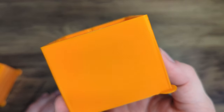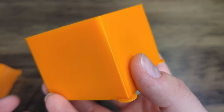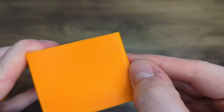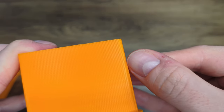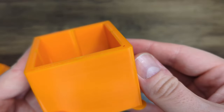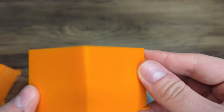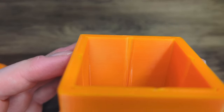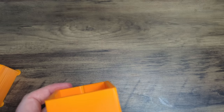get a clean tower. Layers below the ideal pressure advance setting will have blobbing at the corners, and layers above the ideal setting can lead to rounded corners and poor extrusion. Inspect the print and find the height that has the best quality corners. When found that height, double check it with the other sides. Most often there are small deviations between the corners, so after double checking it, take the lowest value and use the formula provided by the Klipper wiki to calculate your new pressure advance value.